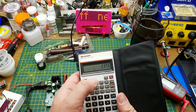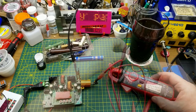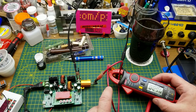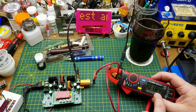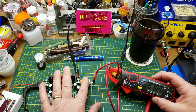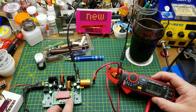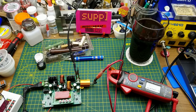These 8-ohm resistors in series should be 16 ohms, which should be about 2.37 amps. I'll clamp the meter on. You may notice these are not typical clip leads — they're made from 16-gauge wire so there won't be significant voltage loss. Currently showing 2 amps, 1.84 amps on the external meter. Those resistors are getting fairly warm but it's happy doing it. Let's turn up the current limit. 2.2 amps, 2.4 amps. Those resistors are toasty warm, and as predicted the wires are nice and cool.